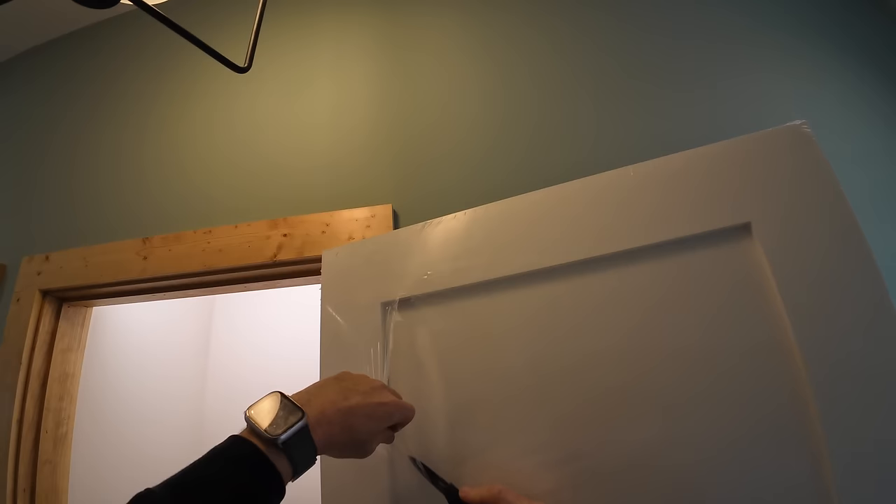I haven't uncovered any of these doors yet - we're gonna do that and see how they feel. I'm imagining we don't need to do any sanding or fixing. The way I'm gonna tackle this is to roll the paint on with a Whiz roller to keep a wet edge on this big panel and then just brush it back, keeping it all wet at the same time so there's not as much chance of brush marks. We did consider taking them outside to spray, but it's pouring rain today and once you spray them you really can't touch them for at least 24 hours.